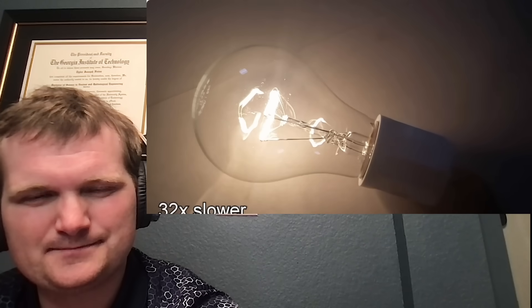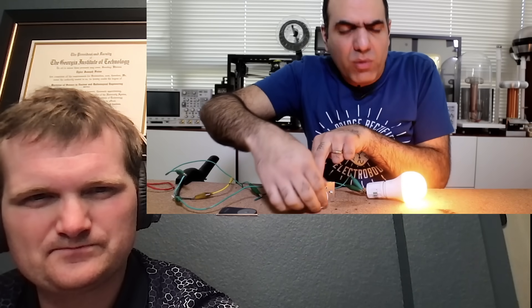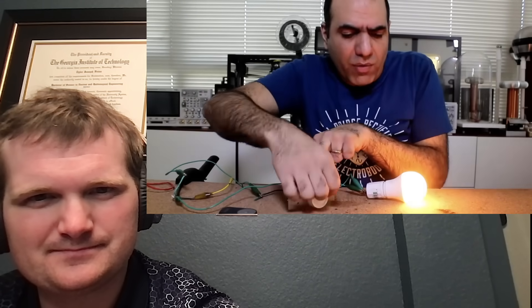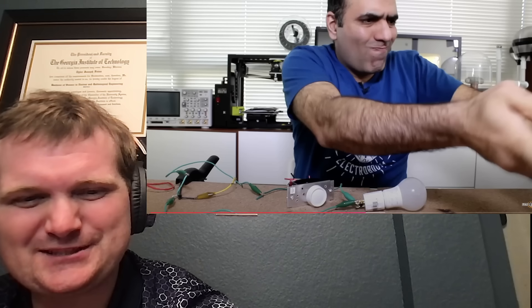He films different lights in slow motion to show the difference. The incandescent brightness changes with the AC cycle as expected. The dimmable LED behaves like the incandescent. The non-dimmable LED has constant light output - it flickers badly on a dimmer because it's designed to maintain mostly constant brightness independent of AC voltage. At very low AC voltages it just craps out. Both have their own benefits: one provides dimmability while the other provides fixed output brightness independent of input fluctuations - a good analogy for why you want fixed, predictable outcomes for safety-related systems.